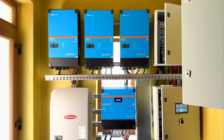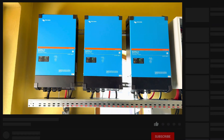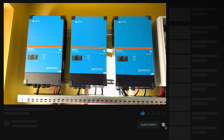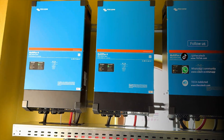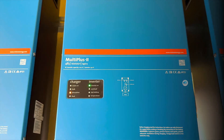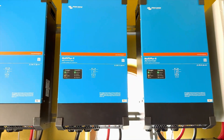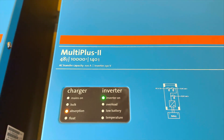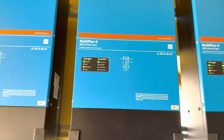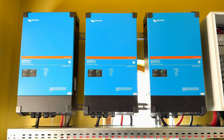Nice to have you back. So let me explain this new setup. I'm going to start with the inverters. Because we are in Europe we have three-phase systems, so we installed three inverters from Victron — each one for one phase — configured into a three-phase system. These are huge inverters, the Multiplus 10000, with an output of around 8 kilowatts each, so 24 kilowatts total. Note: 140 amps. This inverter has a built-in AC charger and can charge the battery even from the grid.